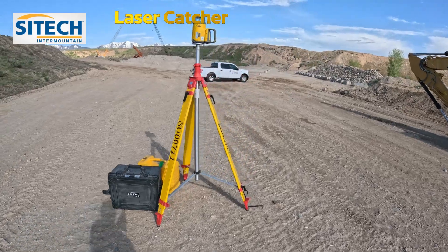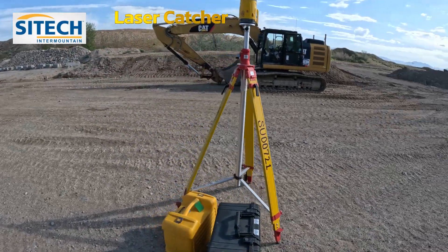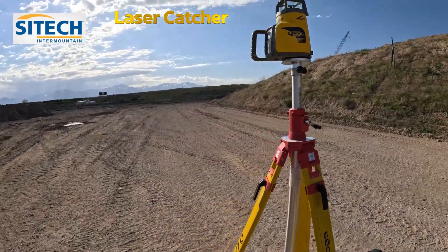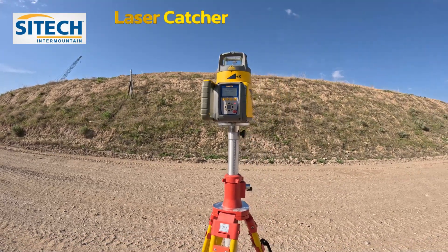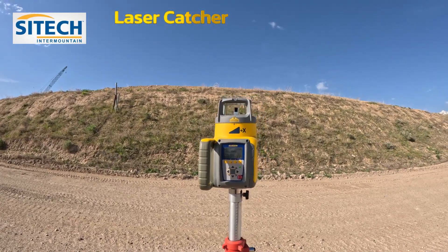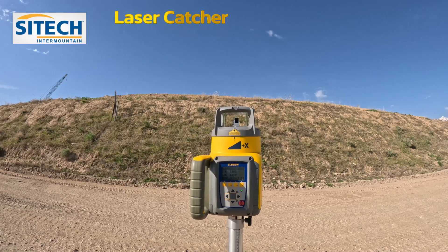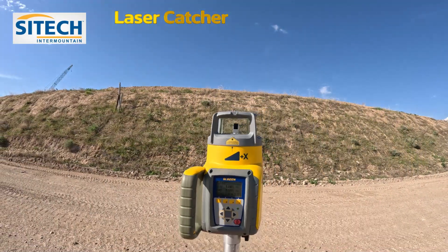You do not have to use a very specific tripod. I brought out an elevating tripod that will allow me to raise the laser way up in the air. You can use the traditional one that's a little bit lower — no big deal. One thing you need to know: when you turn the laser on, depending on what laser you have, the machine has to have the laser on the faster rotate — the higher RPM. There are lasers that have a slower RPM and a higher one; make sure it's on the higher one. Right now we're going to leave this laser perfectly level, and once it levels out we'll get it spinning.